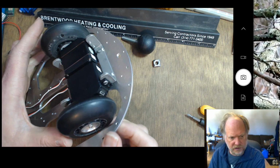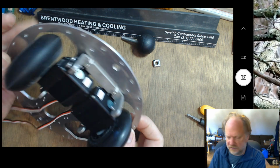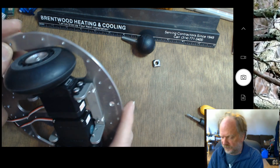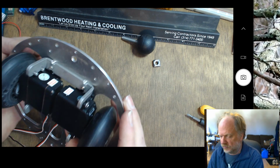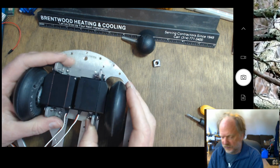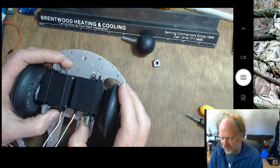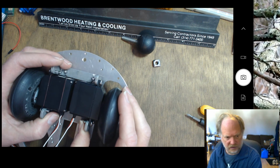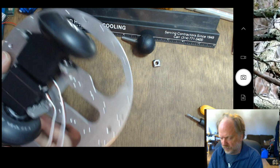It's important to look to make sure that there's plenty of clearance between the wheels and the frames, that nothing's going to be rubbing. This would also be a chance to make sure that it's pretty well aligned. You can do some subtle alignment, like I said, by loosening and giving a little torque and twisting the assembly to make sure everything lines up as well as possible.